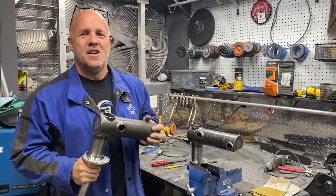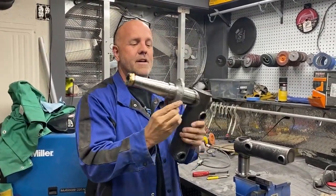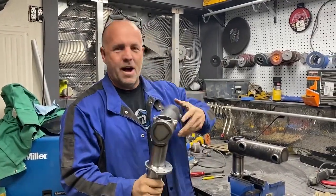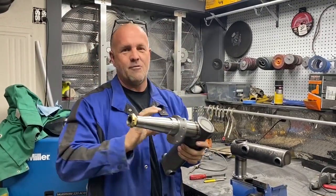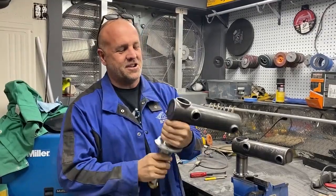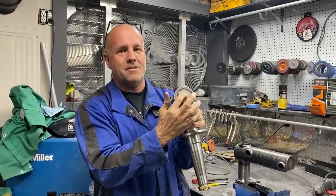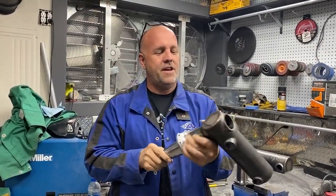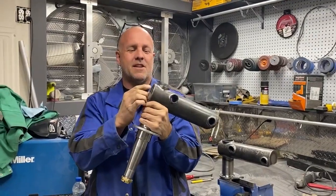Ready to finish the last of the welding on this, which is putting on my brake caliper plates. I've got them clocked, tacked, but I want to talk about a couple little tricks. If you get to machine and weld, there's some little tricks you can do, like this cap right here. When I made this end plate, I made it about a 16th of an inch small all the way around, and that way if you get a real close look, when I know I'm going to be the one welding, it's just nice to make little steps.